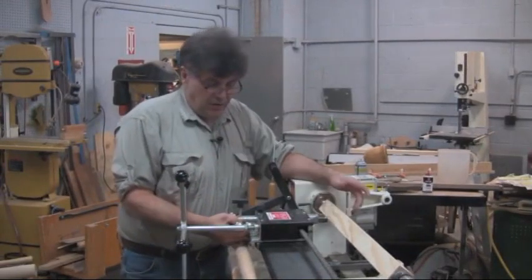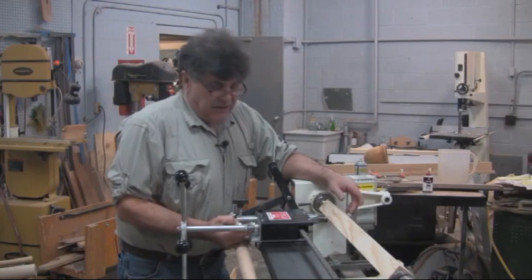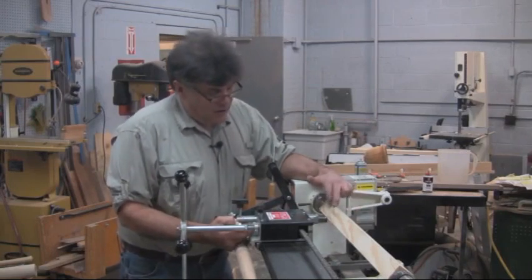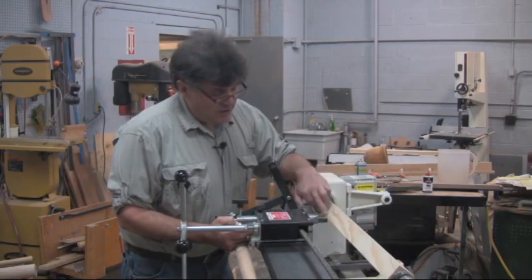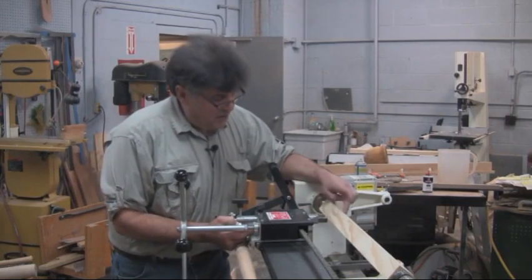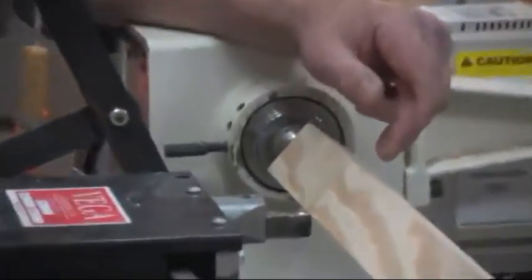Because the first thing I want to do is come into my round. Now, because of the V shape of the cutter, something like a square corner you're going to have to clean up with a chisel. The V shape's not going to. So, just as we did before, I've taken a saw and sawn all my corners and I've got my tape wrapped around to prevent tear out.